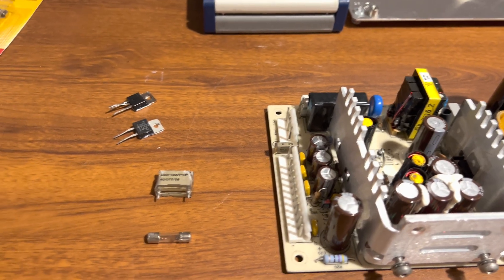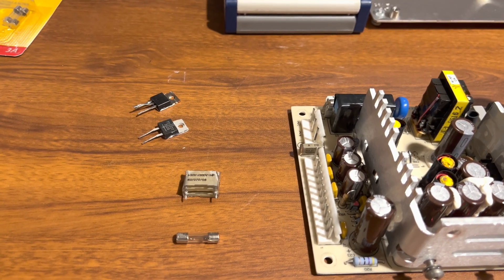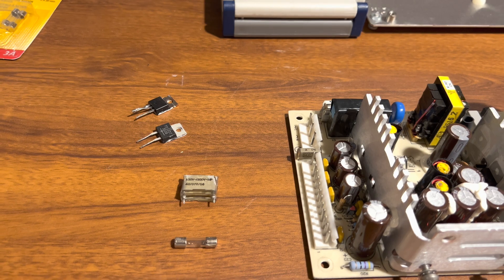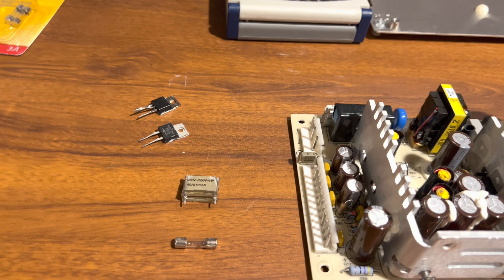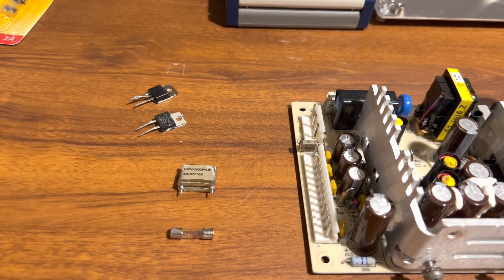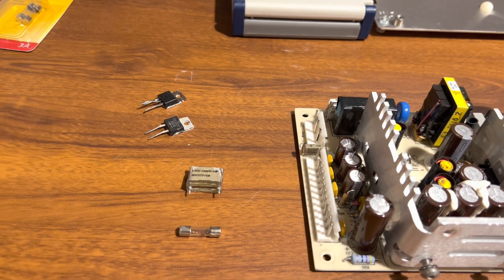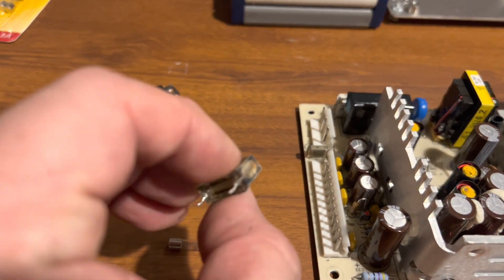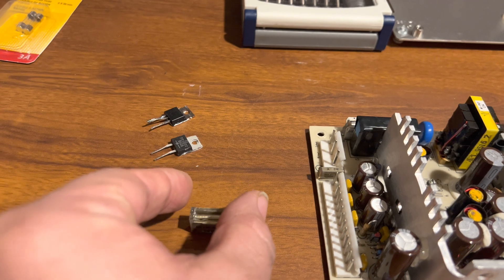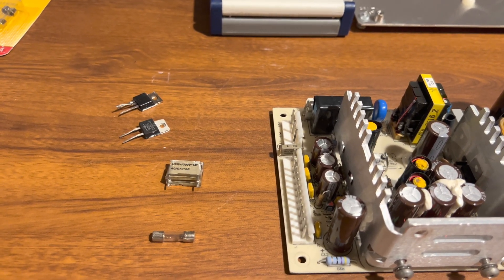I kind of knew it when I opened up the case because you could smell the distinct smell — almost a resin-y, sweet type of smell when they go bad. Unfortunately, when they go bad in your house, that smell can be really strong and stink up your house for days. This one didn't actually fail catastrophically, which I'm shocked about. Usually when they fail, they blow their guts everywhere and leave that smell behind. But if you see any capacitors encased in this resin — you can see right there where it's blackened and a bit charred — just replace them. Do not take a chance with them whatsoever, because they will fail, and when they do, they fail quite spectacularly.